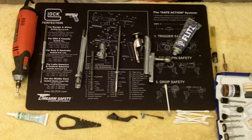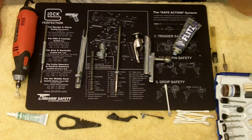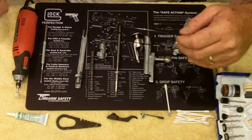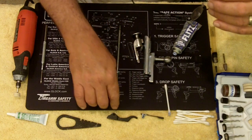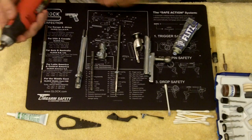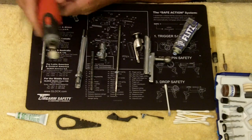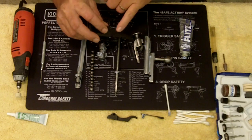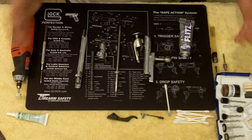Hello YouTube, I'm back. I got the oven turned off. I brought the barrel, the receiver, and all the little parts up to 150 degrees. I let it sit for a little while, then turned it off. I'm going to let them sit in the oven and come back down to room temperature, then we'll take them out, wipe them down, make sure everything looks good. In the meantime, we're going to go ahead and start buffing the bolt, the sear, and the trigger. I won't show everything because it would be a long, boring video, but I'll show the main things. I got a new buffing pad on the Dremel. I'm going to put it on medium speed. Very controllable. All I'm doing, once again, is just buffing. So once we get everything ready to go, to my liking, and back together, we'll go ahead and gauge it, make sure the firing pin is where it needs to be, everything's good there. Then we'll go ahead and put the rifle back together. Hopefully it'll be a good video.